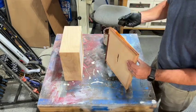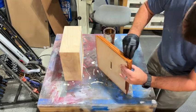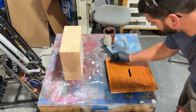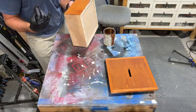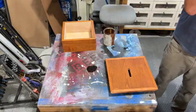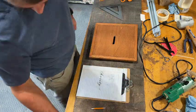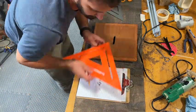Now we're going to go ahead and apply the stain to the project itself. Now we had to backtrack a little bit after this, as we wanted to burn Charity underneath that notch into the lid. But as you can see, this is the process of staining. That wiping stain really takes onto the wood quite well, and it will match the existing actual oak to the plywood, and you won't get any blotches that way.